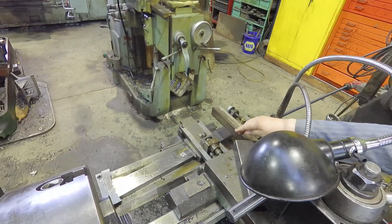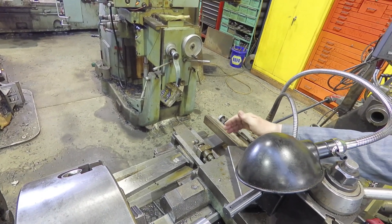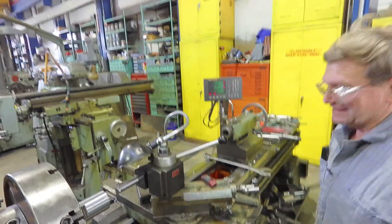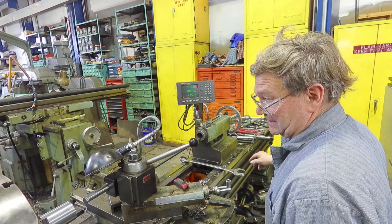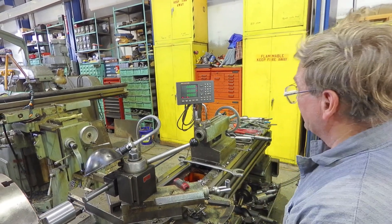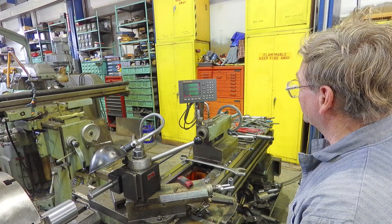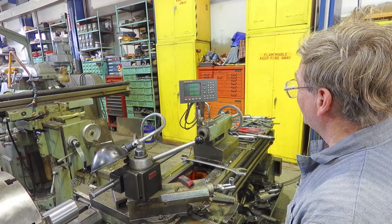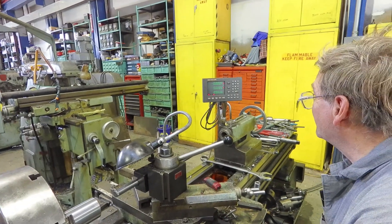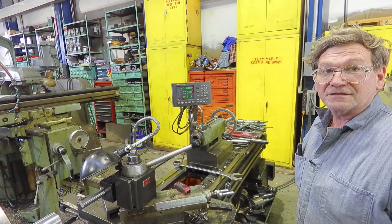The slop could be in the cross slide lead nut, the screw, the bearing on the end — all of that. As you can see, I am done cutting this taper. If I zero this out and see how far we have to move before the cross slide actually starts moving — you've got to go quite a ways even with a two-inch taper. We had to move almost an inch lengthwise before the cross slide started catching up with cutting the taper.